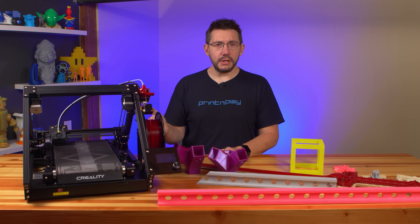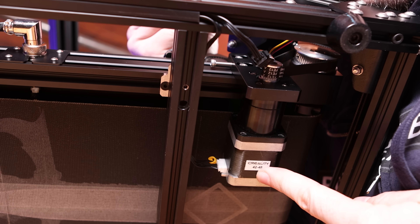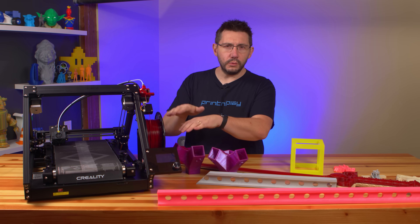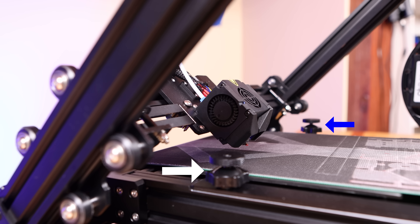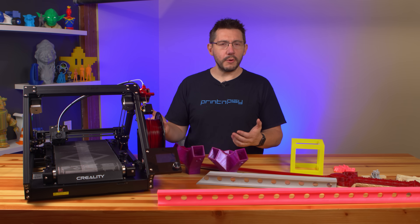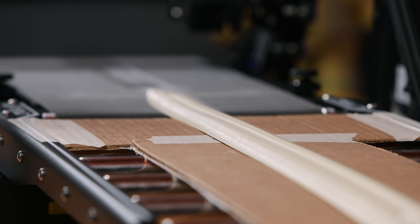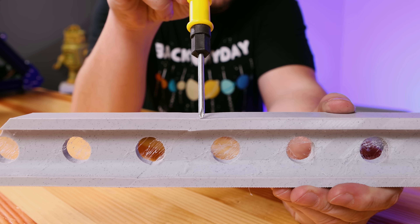The belt is tensioned between two rollers, and the roller in the back is connected to a gearbox with a Z motor driving it. There are two metal plates under the belt top, with one being heated and the other being a cool-down zone. Both plates have adjustment knobs at the sides to raise the plates, though on my machine they are both too high, even at their lowest adjustment point. I've heard this is fixed in newer pre-production machines, but this review is based on mine. Having the two metal plates not level with the end roller means a slight downhill is introduced, and this is what caused the issues on the first I-beam I printed.